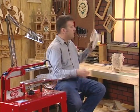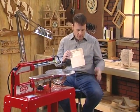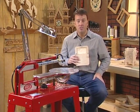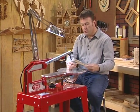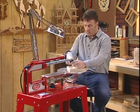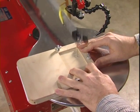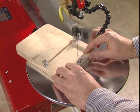Let me show you a great project. I've taken some plain old paper from the local office supply store, cut it in half to make personalized stationery size, and put it in a little shop jig I made. You could also put cardboard on both sides of your stack of paper and simply cut it out. I've taken a couple of initials — the K and the C — and cut them out the same way we did inside cuts before: release the tension, feed the blade through the drilled hole, and make the cut. You can cut paper at high speed just like you do wood.